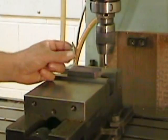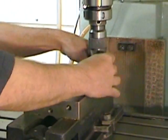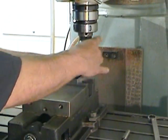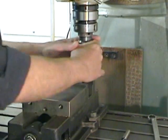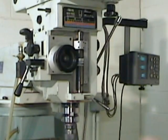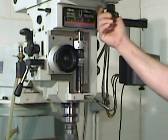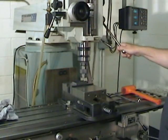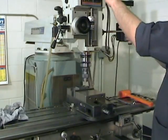Producing guide holes for drilling requires the use of center drills. Now, this center drill is short and rigid, and will position the hole much better than a long series jobber drill. For this number 4 center drill, we're going to require somewhere around 800 or 900 RPM. These center drills aren't made to drill through holes. Only about two-thirds of the 60-degree V end of the center drill should penetrate the work surface, never more.